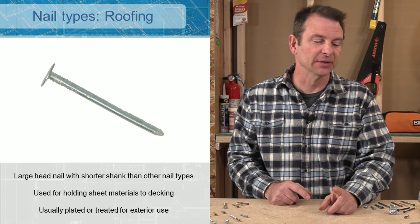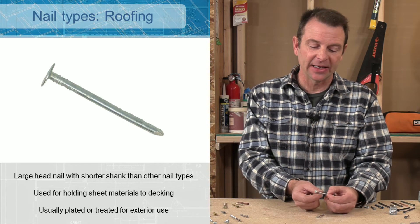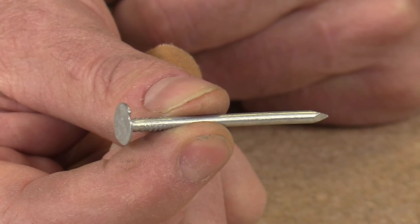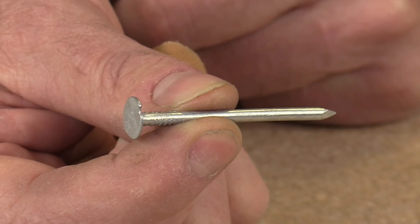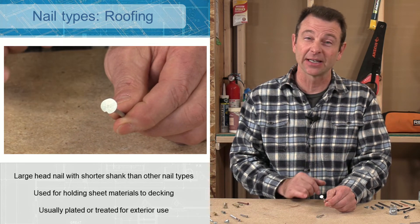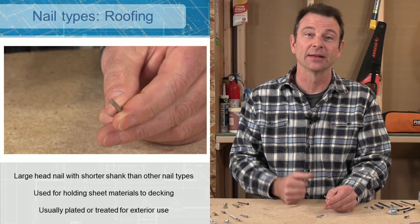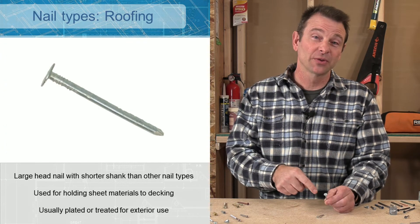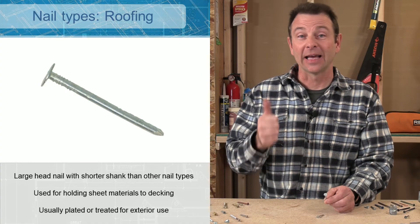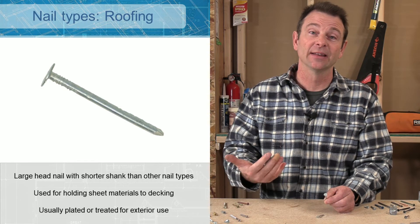You will surely see a roofing nail when building. Roofing nails don't tend to be very long — a two-inch roofing nail is about as large as you'd typically use. They're shorter because they're holding thinner materials to a base. They have a very wide head, even bigger than common nails, for good clamping on thin material, and a simple diamond point. Roofing nails are used in many applications where thin materials need to attach to a solid base — including roofing and fastening window flanges to sheathing on the exterior of a building.